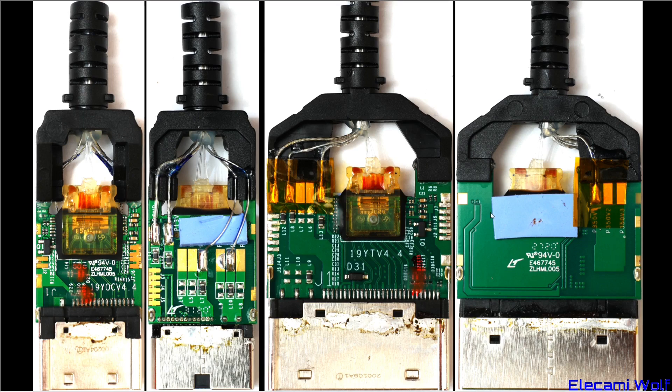I've taken some pictures so we can see both sides of the One Connect box end and both sides of the TV end. We can see there is some capacitor coupling on two pairs — there and at the other end. There are four pairs: one, two, three, four, and again at the other end. This connector, which is the double-row connector on the One Connect box end, has surface-mount pins for the top row and through-hole pins for the bottom row, whereas the TV end is just a single row, all soldered surface-mount on one side.